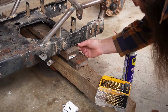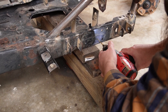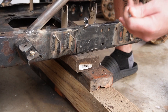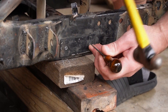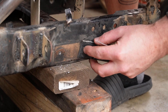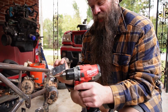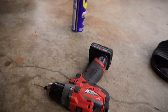It would be kind of cool to strip the paint off of that and see what the name tag says. They spin immediately because they're pop rivets. Let me grab an awl and go straight down the center. Sometimes you punch the core out, but usually you can go down the center and expand that core just a little bit, re-stick the rivet, and drill again. Once it's fit back up in there — it's just a serial number, it's a data tag. I thought it was gonna be like printed — Yamaha Motor or something. It's spray painted so maybe there is something under there.